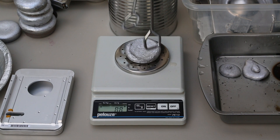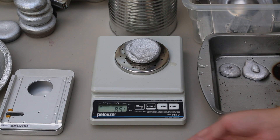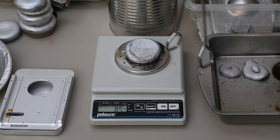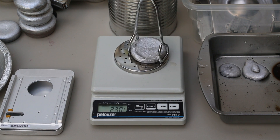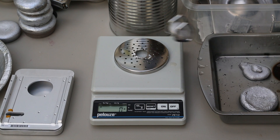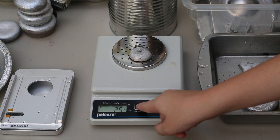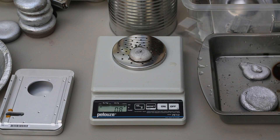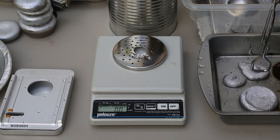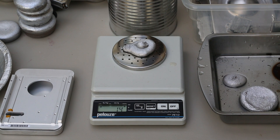The aluminum parts produced the highest yield ratio — we started with 3.4 ounces or 100 grams and ended with 3 ounces or 85 grams. The hard drive platters started at 2.6 ounces or 75 grams, but we only recovered 0.8 ounces or 25 grams. A pound or 450 grams of aluminum cans usually yields 3 to 4 ounces of aluminum, but because of the leak, we only had 1.4 ounces or 40 grams.